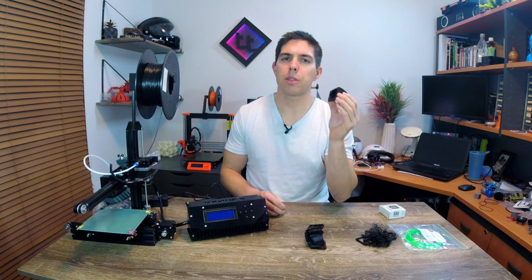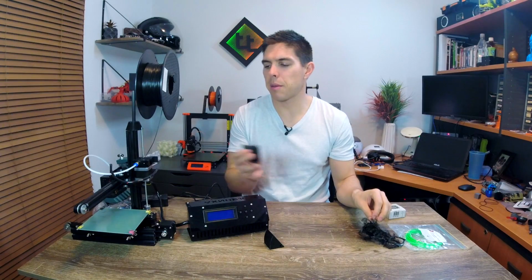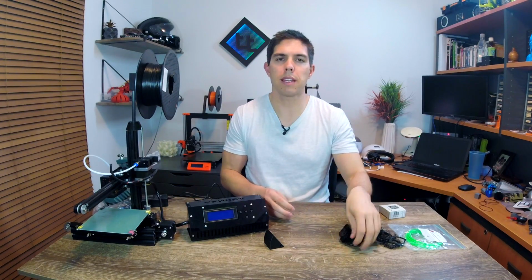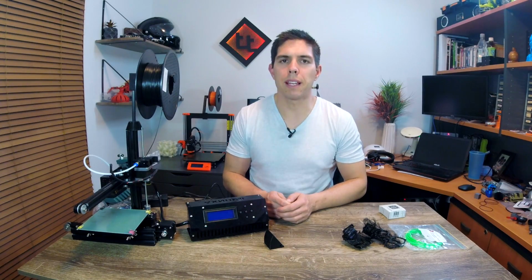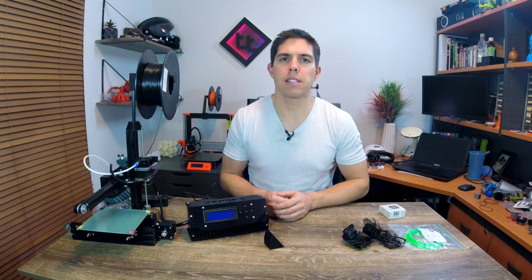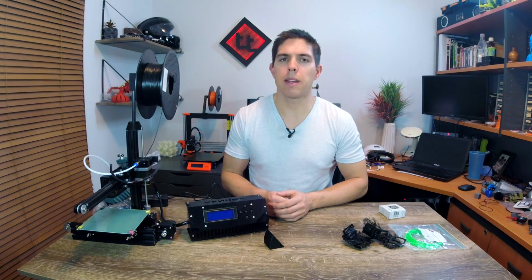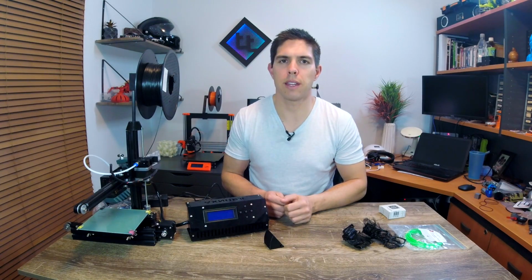So this took 3 attempts. The first 2 were complete spaghetti. That's because it came loose on the Garolite build plate. Just another way that they save money. It doesn't have any sophisticated auto bed leveling or anything like that. You need to keep it spot on, and it pays until you got your printer really dialed in to pay attention to the first layer and to do some live tweaks as you go, just to make sure it's okay.